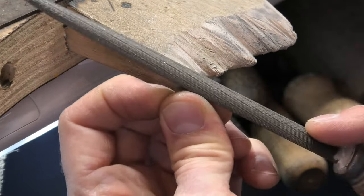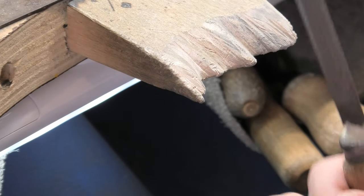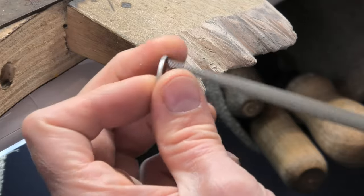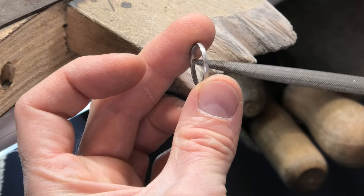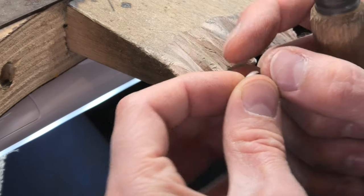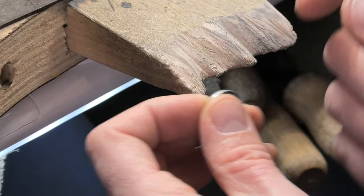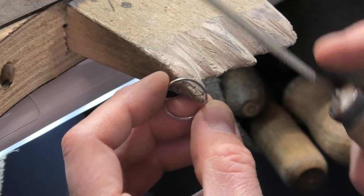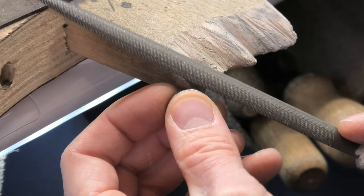There are risks to working in jewellery. You can only really stretch rings up that don't have any settings — no holes in there. Because a hole drilled in it is a weak spot, and it will only stretch on that weak spot, and it will just tear apart any settings. So only try to size up wedding rings, wedding bands with no stones set in them.